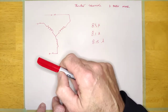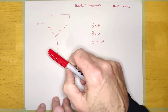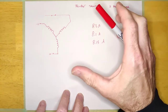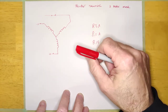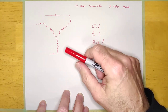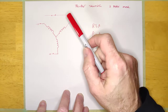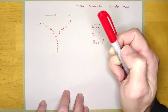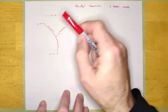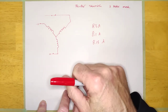Those are some tips on troubleshooting a three-phase motor. It's really nice because you can compare your numbers to the other phases. If a motor is blowing fuses immediately — and this goes for single-phase and three-phase — there are two kinds of things that happen. One is the motor runs for a while and then trips the overloads. The other is you can't even get it to run — you turn it on and it goes boom, fuses blow or breaker trips. A motor running and hitting overloads is usually related to the load. But a motor that trips overloads immediately is usually related to the windings being shorted, and you can usually find that with a megger or an ohmmeter — you'd also usually smell it.